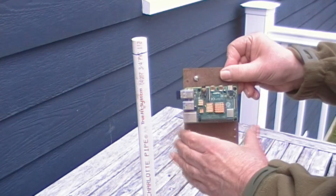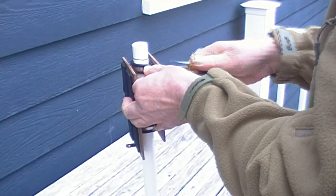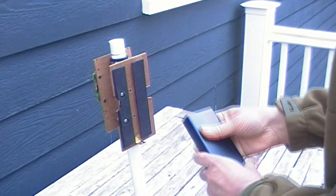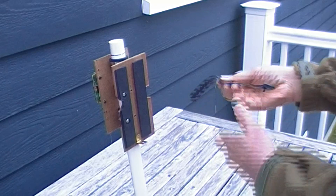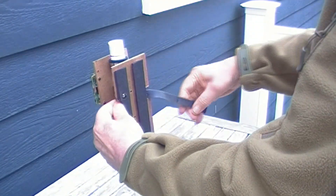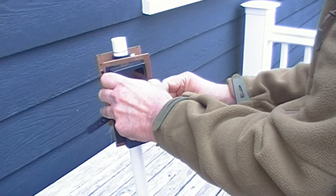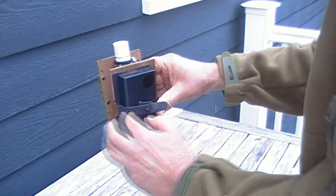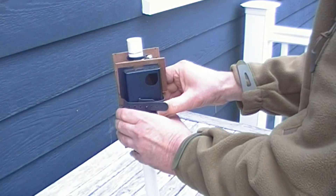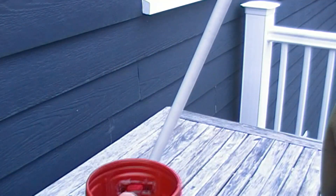The camera consists of a Raspberry Pi 4 — this one is the 4GB model — loaded with a 32GB SD card. A 65W battery pack powers everything. It's a little overpowered and costs as much as the Pi, but it runs everything, and at the end of 13 hours there is still 40% power remaining, and that's at below freezing temperatures. There's plenty of reserve left for expanding functionality.